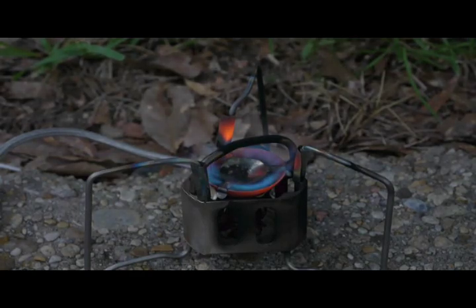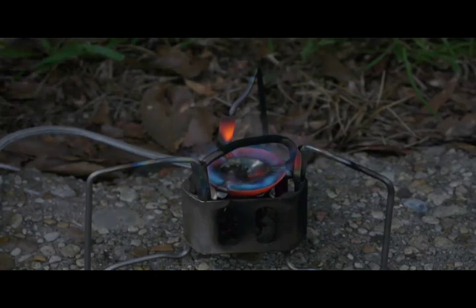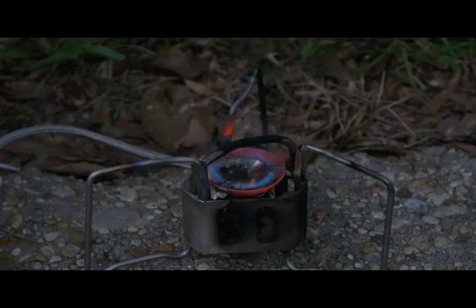In contrast to the previous kerosene test using the 37 jet, where simmering would have been out of the question, I'm going to try to see what happens if I can get this into a simmer type state. I'll be surprised if it works. Kerosene is difficult to work with for some of these stoves. But certainly the 28 is a better shot at trying to get some kind of a simmering capability compared to the 37.